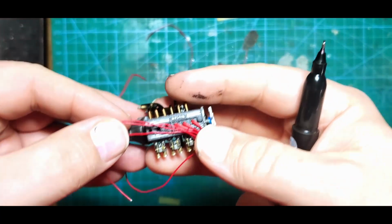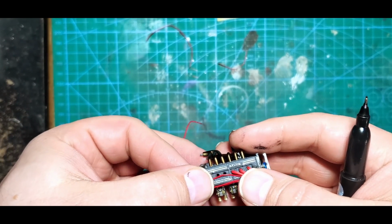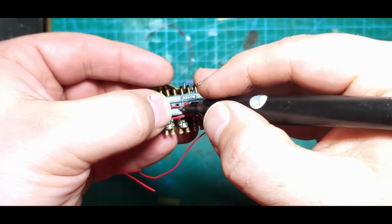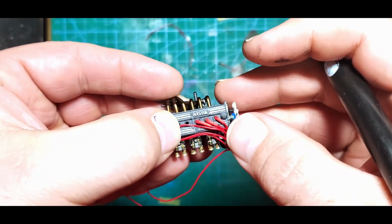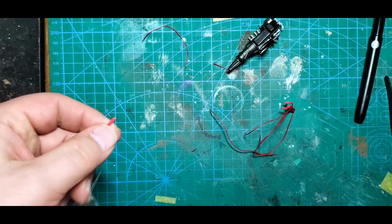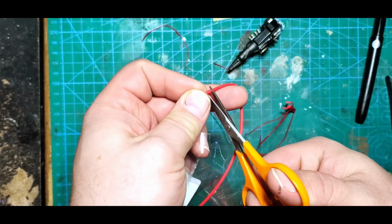So of course I got halfway through the plug wires before I realized the camera wasn't recording. Nothing's glued in yet, it's just dry fit for now. We'll line up this 30 gauge wire and place a mark. Then we'll take everything off to play with fire. We're going to take some of this 3/64 inch heat shrink tubing and slide it over the wire so it just overlaps our mark.